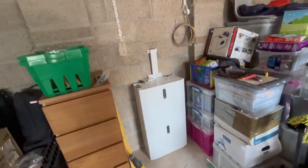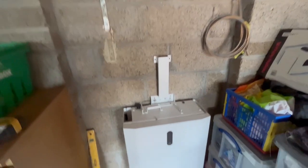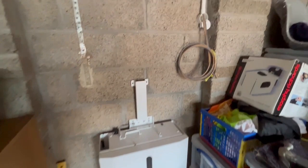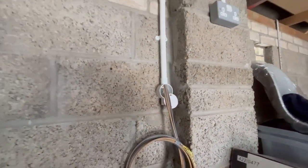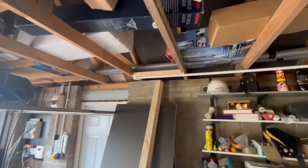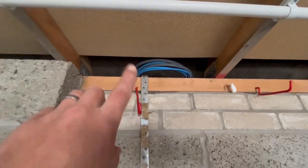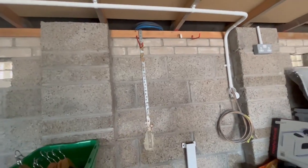Graham is just starting to build this Libby — still got the inverter to go on top. So that's two batteries: a five kilowatt hour and a second five kilowatt hour. We have our DC cables run from the roof. I'll show you that route outside in a bit, but it's nice and tidy inside. We've also got a supply up here along with the cat cable — that's six mil for five kilowatts and four mil for 3.68.